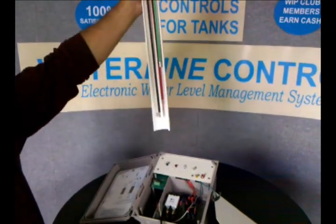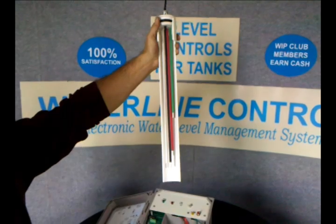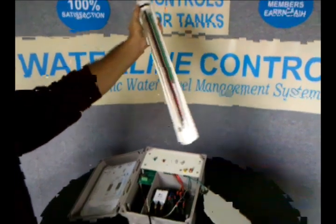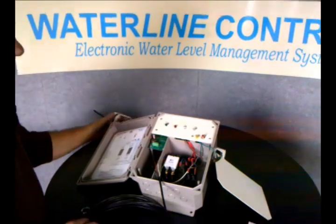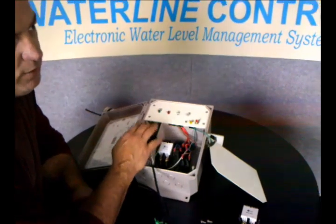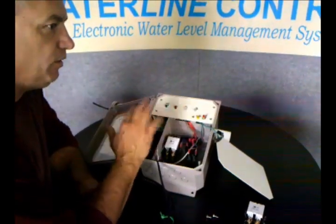This probe comes at a minimum of about 22 inches long, but they come up to 11 feet long, and the contractor can cut them in the field. It's a function of how big the tank is — it's designed for a well holding tank or a cistern. It's all modular construction, so when the relay fails you just replace the relay, and if the circuit board fails you just replace it. Basically, it's one kit for everything, all in one assembly — no float switches, it's all electronic.